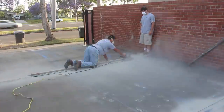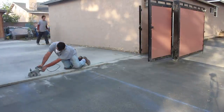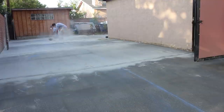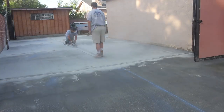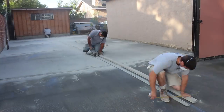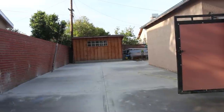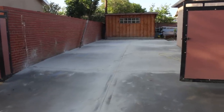I'm cutting about three-quarters of an inch deep and using the straightest two-by-four I can find as a guide. Because the concrete is so fresh, I put a piece of plastic underneath the guard of the skill saw plate so it's not dragging on the concrete — less resistance, easier to push, a lot of benefits.